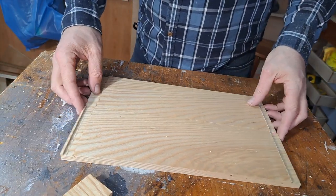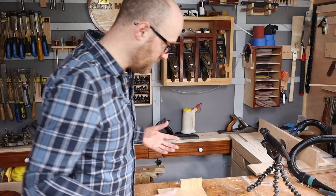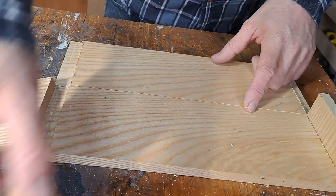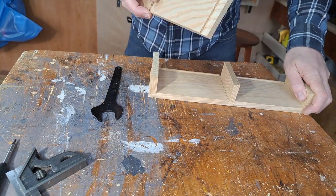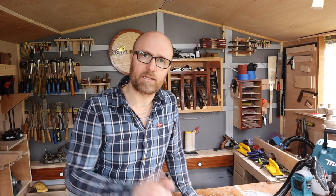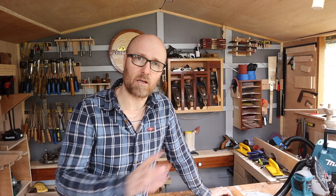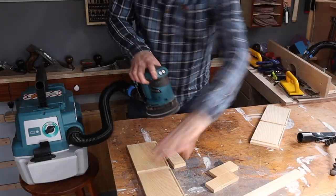Now you've got the rebates how you want them, lining up with each piece and with enough space to sink the blocks into them. It just needs a little bit of a clean-up and then we can start gluing the box together — except I might put a rebate in to sink the base a little bit higher up, and I also forgot to rebate the middle one. The dry fit's done, everything goes together nicely. Be careful with that bottom panel — you want it to move a little bit but not hinder the outsides. I'm now going to sand the inside, taking it through 120 up to 180. I'm not going to go for too much of a special finish, but you won't be able to get in there later, so doing it now is perfect.